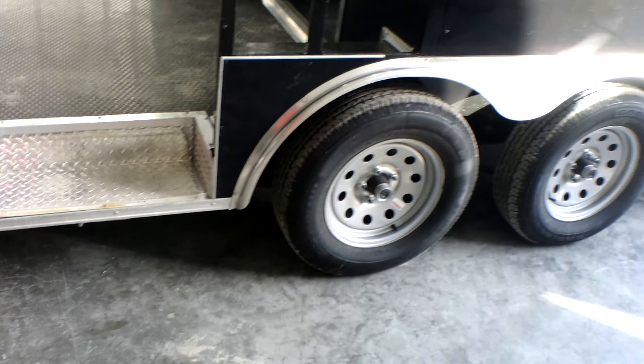That's your five-foot porch area with your rear removable railing. Always make sure that you have a pin in the railing on both sides — at least the top side to protect it, or you can have top and bottom — to make sure that you do not lose this railing. In transport, you have roller wheels here on the rear of the trailer to protect the scissor jacks. These scissor jacks can be let down with a three-quarter inch socket and an impact gun — make sure you do it in equal increments, not trying to lift the whole trailer by one jack.